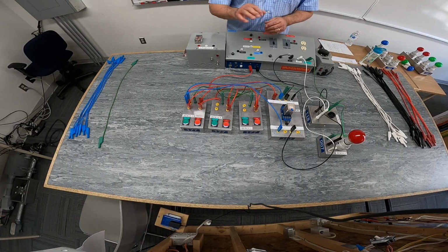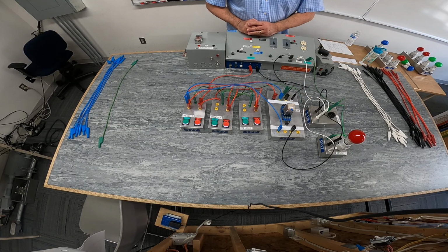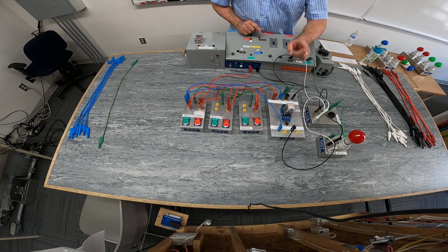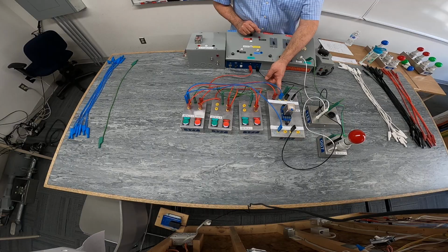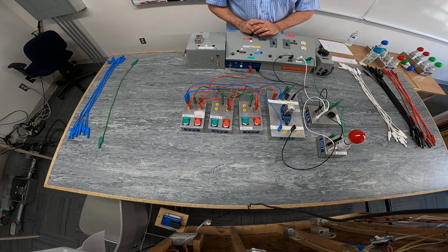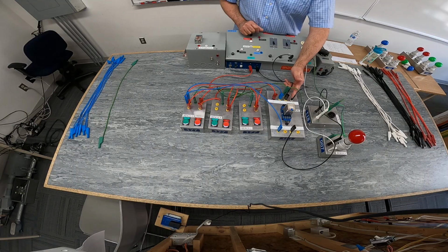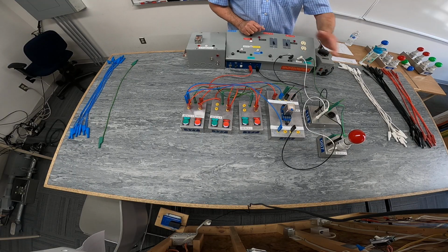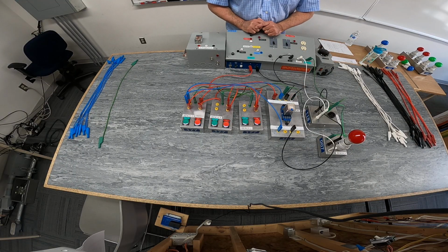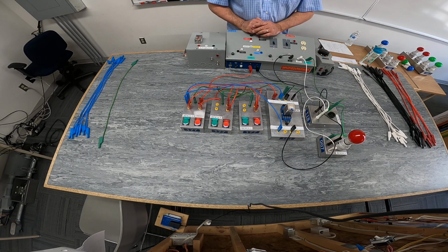We have to ensure that whenever we're dealing with two different voltages, that we never mix voltages on our contacts. I use two different armatures. The armature with common number 1 was being used for 24 volts for all of our labs here. And the armature with common number 8, I used it to work my 120 volt side. So make sure we never mix those terminations there.